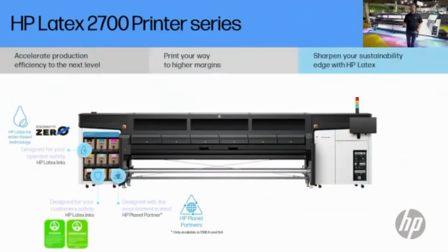So a few things about the printer as far as sustainability is concerned. You see all these logos around the printer. Most of them center around the workflow with the ink system. HP Latex ink has always been environmentally friendly. It's a water-based ink. Water-based meaning water is the vehicle that delivers the pigment and the polymer to the page. So once the pigment and polymer are down, the water evaporates, and that's our only VOC, if you want to call water a VOC. The water escapes through a drying process, and then we cure the latex ink and it's done. There's no more gassing off, so there's no more VOCs to escape into the air.